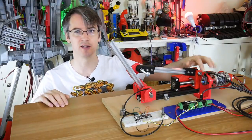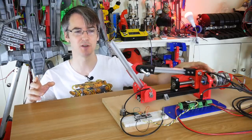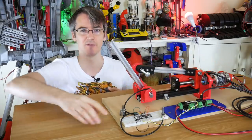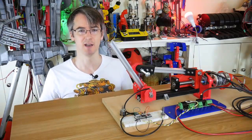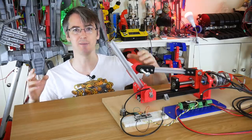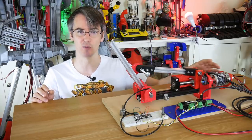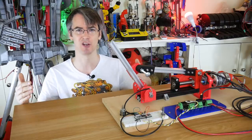It's worth pointing out again that the O-Drive positioning using the encoder is highly accurate to position that motor. The only problem I'm trying to solve is that once you reboot your master controller and you've homed your actuator, the O-Drive can't remember that zero position. Basically every time I reflash the code - in this case we're using a Teensy and the robot has Arduinos - it means I'd have to home those actuators again. So probably what we will do is read the absolute position of the leg and then use the O-Drive positioning with its closed loop control, which is highly accurate and highly stable.